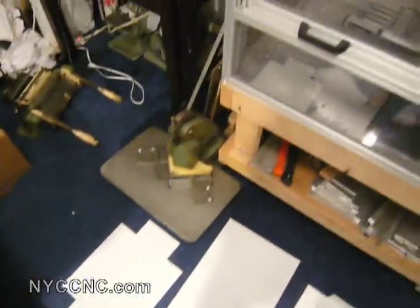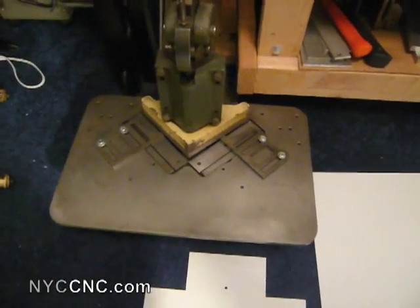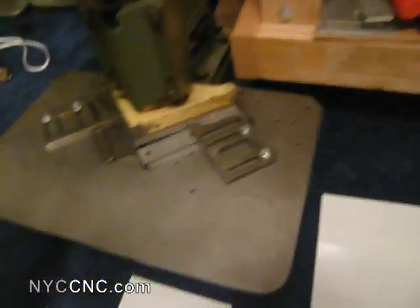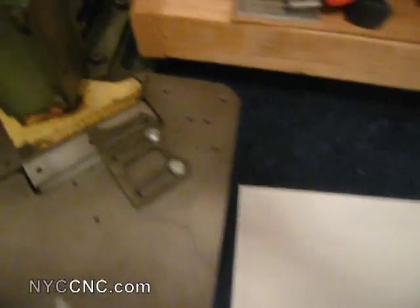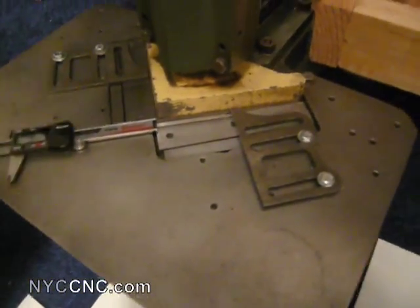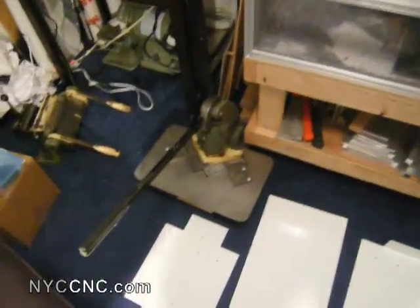You'll see it goes to the corner-notched piece right here. I do that in my Diacro corner notcher — that's a six-inch notcher. I spent quite a bit of time tramming up these two points. I used a caliper to measure down to the depth of this part to get it exactly at three inches, and then cut a couple test pieces to get it set just right.